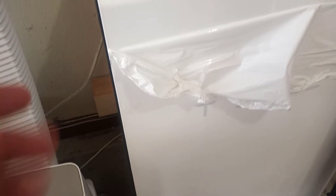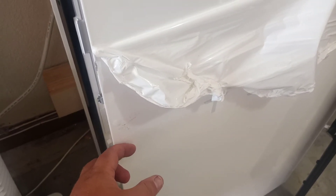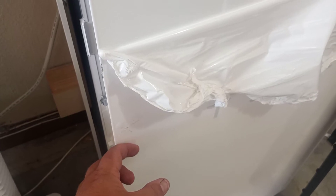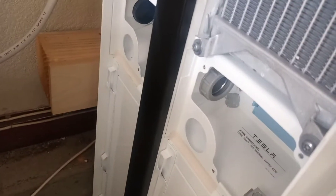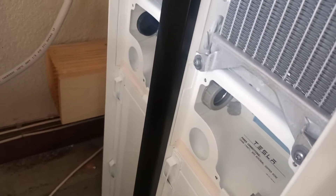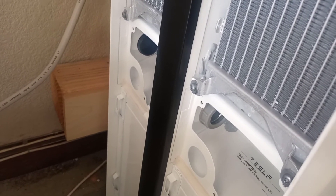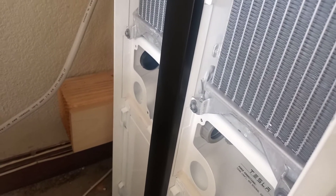Make sure you're taking your time with this — you don't want to hit anything inside. Once you've done that, you're going to slide your second unit on and you'll have a spacer that comes with it, which is a close nipple. You'll have two rubber washers in between, and then you'll have the plastic bushings on the outside. This is not what holds it together — this is just making a chase in between. The rubber washers need to go on the inside, and then there's a plastic bushing that gives you the exact spacing in between.